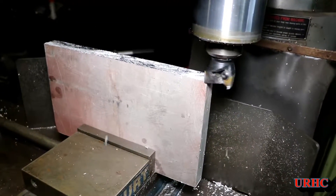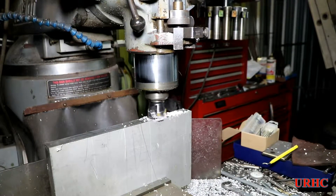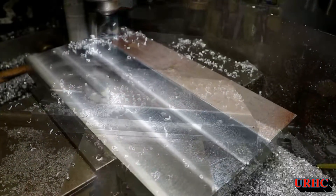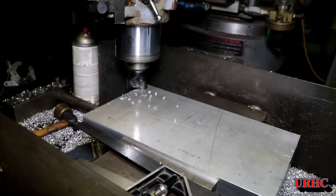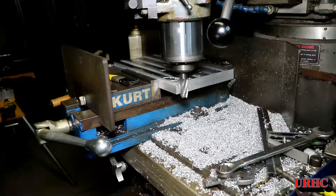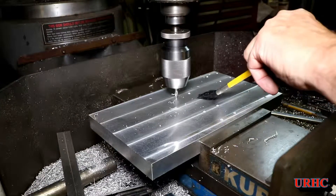Just like woodworking, you start by roughing things out to size and then go back to square and flatten them. I'm going over to the mill now, getting one straight edge on each piece, then flipping them to do the other edge. The surface of the parts is a little bowed, so for the parts that need to be flat I have to take a couple thou off each side. Having a power feed on the mill really makes the job go quicker. After squaring up the ends, I've got my first plate ready for holes.